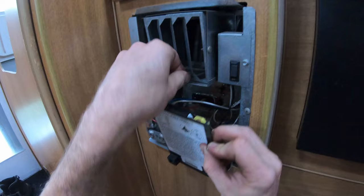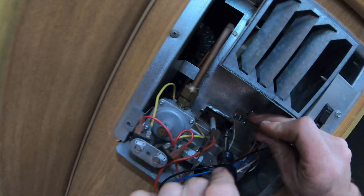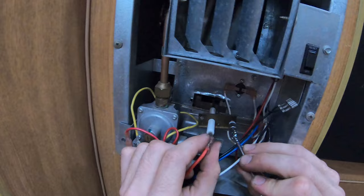You've got these quarter-inch screws — you could use a flathead or a quarter-inch — took these two off, then pop your circuit board down. Just behind that you have two more quarter-inch head screws on what I guess is like a thermal plate on your igniter. Behind that, holding the igniter in, are also quarter-inch screws. Make sure when you take them out you use a magnet so you don't go dropping that screw into the furnace. The igniter only goes in one way — short side on the left looking at it.